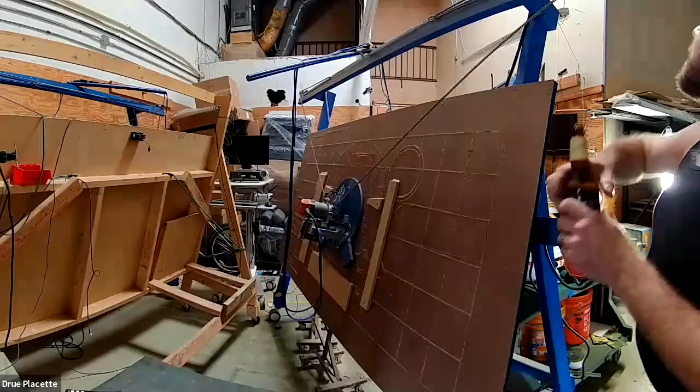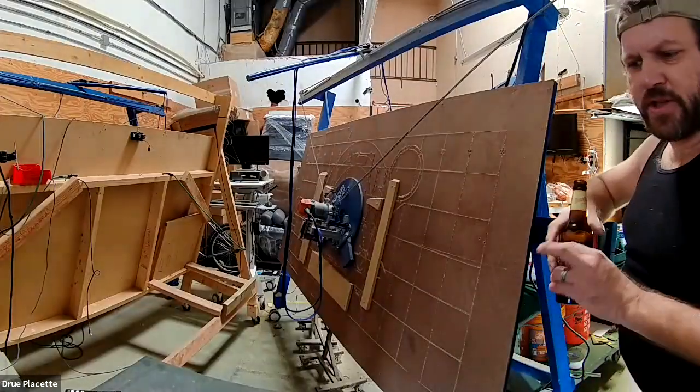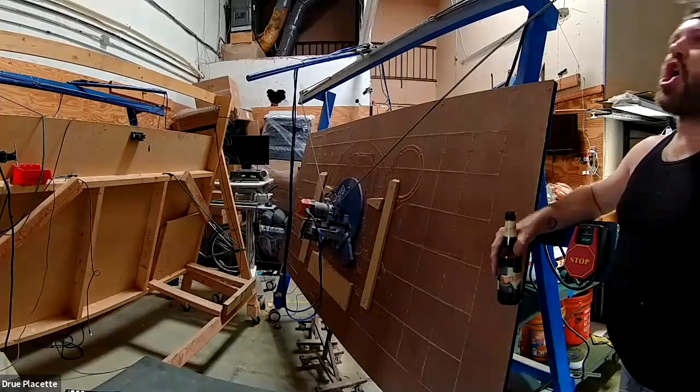Gotcha. Hey, look at your machine. I think I know what that other guy's problem is now. The guy that was going up whenever he was going left and right. I think he's hitting his chain slack now. That's what I was thinking too. I told him, he said he was at 6 inches though. Yeah, but when they showed him, he's at 6 inches, but 1 inch from the bottom, not 1 inch from the top.